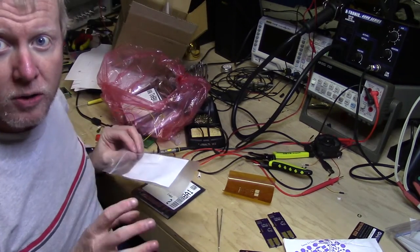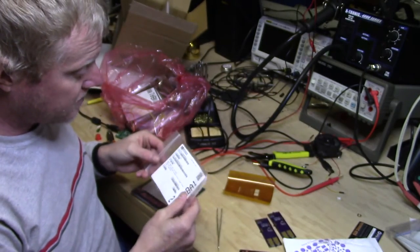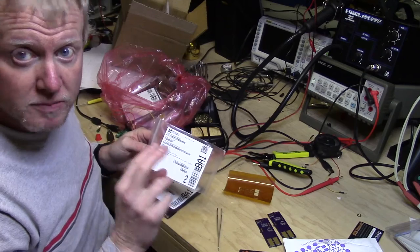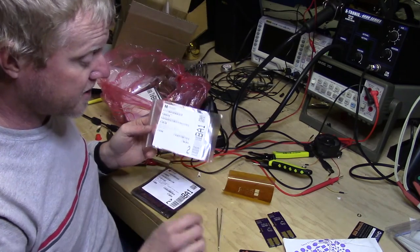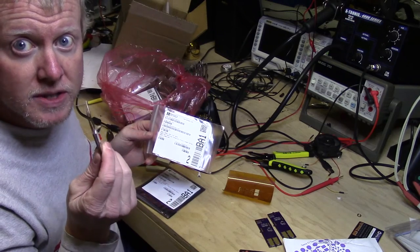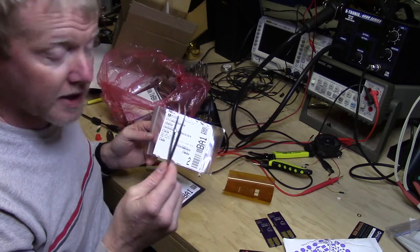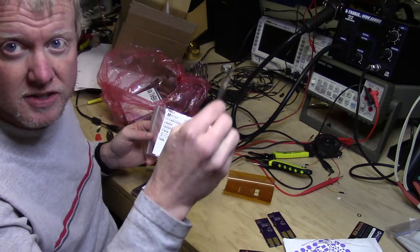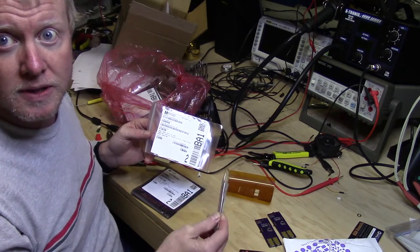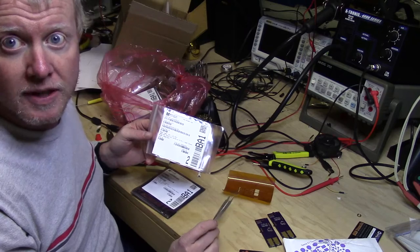Okay, I'm not going to bore you with the whole assembly. I'm just going to show you the quick process and then I'm going to place the part. But basically, this is going to be Cat 3 and that's on the back side of the board. This board has parts on both sides. So we're going to place it real quick, and ideally a vacuum pick or a set of tweezers. I usually use tweezers on smaller parts and a vacuum pick on larger parts. It's a lot easier to go straight down rather than having to worry about your X and Y placement. The vacuum pick will actually let you kind of angle the part and drop it straight down.